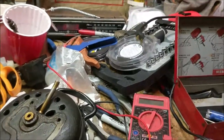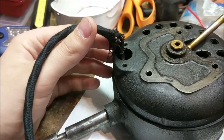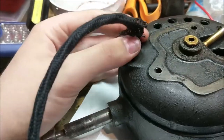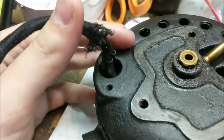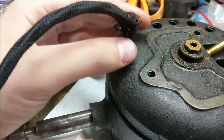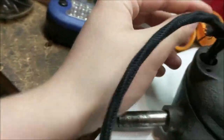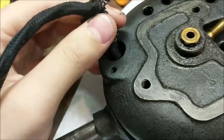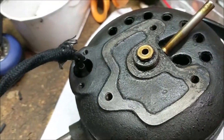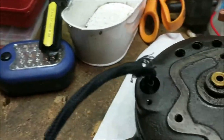It's been a long time since I got back with this fan. I was trying to get the stator out and that didn't work, so I heated it up with a heat gun for about 15 to 20 seconds and then pulled it out. Make sure not to hold it in one spot — move it around a little. I was able to slowly pull these wires out and get enough slack to use my wire strippers.